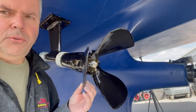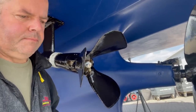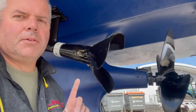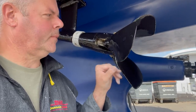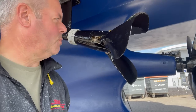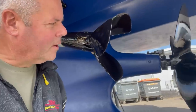The main prop has now had its fourth coat of anti-fouling treatment. That's the top coat: epoxy one, epoxy two-coat paint first, then a bonding coat, and then the top coat. It's horrible stuff to put on - it goes everywhere. It's quite sticky, almost rubbery - weird. But hopefully the little critters won't enjoy living on that. It costs about £120 to paint these propellers just in paint alone.